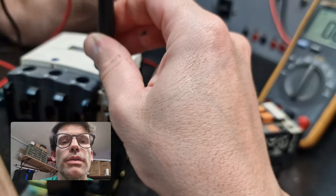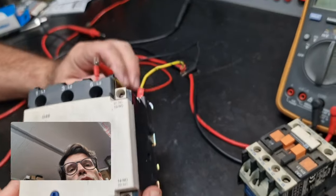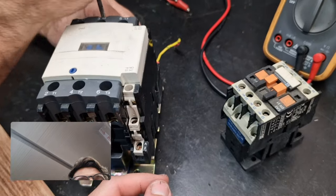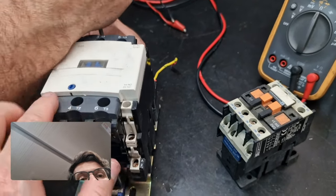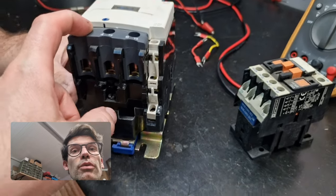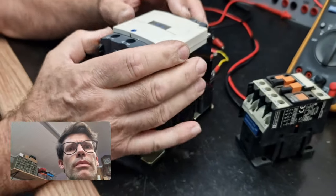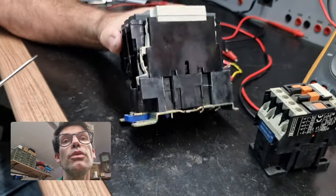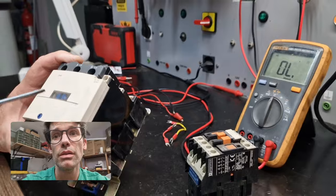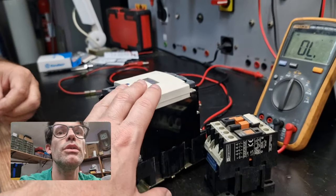It's making more noise because we didn't tighten all the screws. The three main poles on this one are all normally open — you can also buy normally closed versions but they're hard to find because normally you just want to close or open a circuit rather than have power passing all the time during normal state. So the main poles are normally open, and then you've got auxiliary contacts for other functions — for the rest of the machine's control circuits and automatisms.